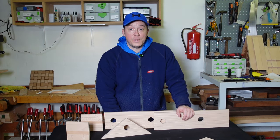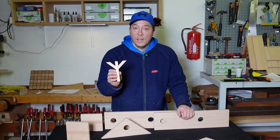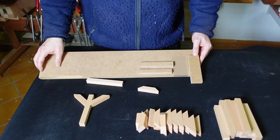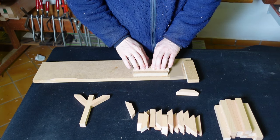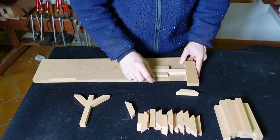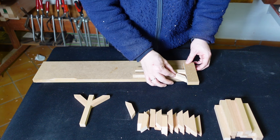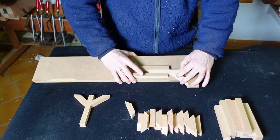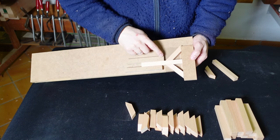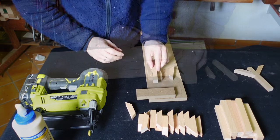We're almost ready to do the surface treatment, but before we do that, I want to pre-assemble these posts. They're a lot easier to do now than later on. I made a small jig for this job and it's very simple. I'll take the post, drop it down, push it up against this. This is a 90 degree angle. These are my 45 degree cuts. Add some glue here, and then I can shoot some nails in from this side. The reason why I don't have these going further up is because I can flip it around and do the other side.